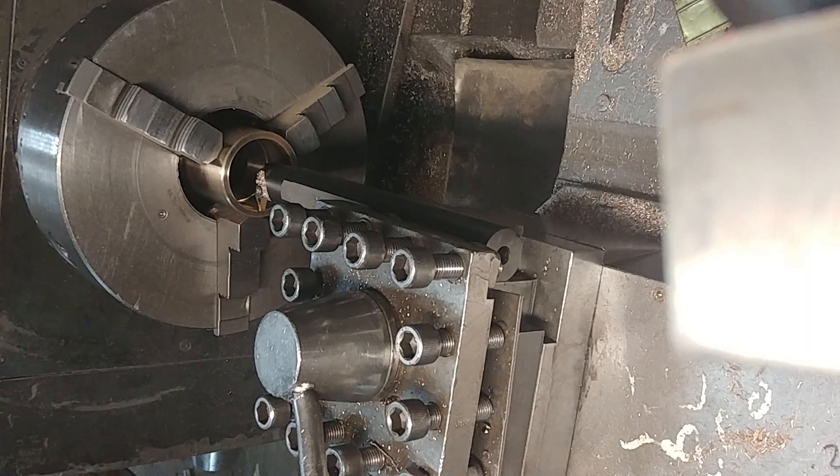Okay, we're all set up. I'm taking a 40 thou deep groove. What I'm gonna do is I got it set to the thread, got my half-nut engaged. I'll go in, reverse my feed, then come back out.